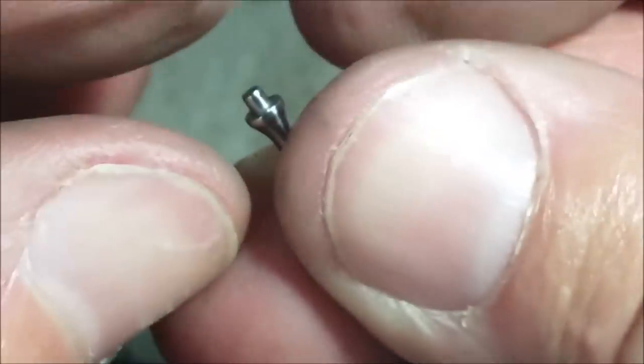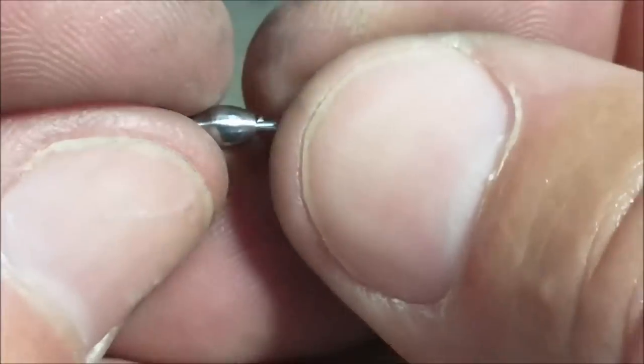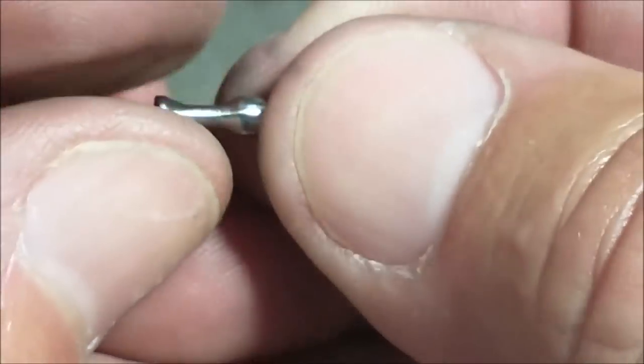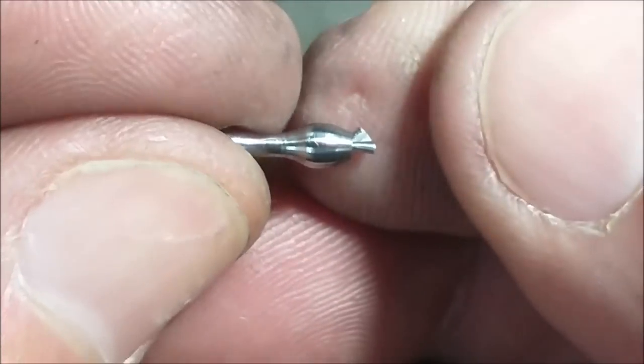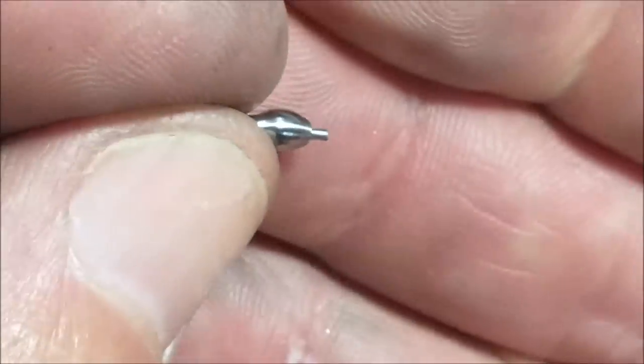I'm going to put it back in the collet this way. I did leave a little major diameter here and here so I can put it back in a cylindrical, face that off and round this off and polish that as well. Then we'll push that on one of those handles that I just made, one of those crank levers that I just made. Call it a day.